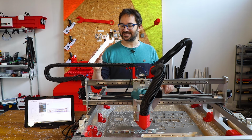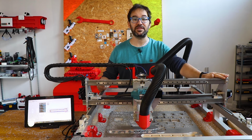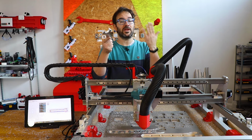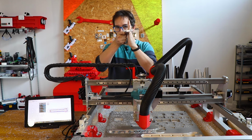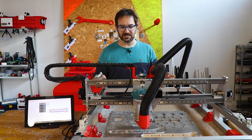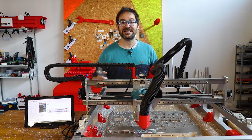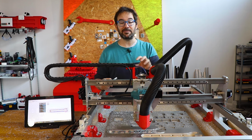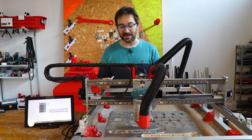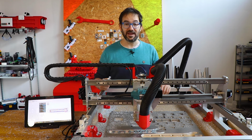So look at this. As you can already see, it was already capable of cutting 10mm thick aluminium. But now I can make perfectly straight walls, because when you want to make a part with another one like this and you need a straight angle, it was pretty difficult because everything was too flexible and the bit kept tilting. Now it doesn't. I even did an 8mm dip cut at 100mm per minute, which is insane. Huge chips coming out of the bit. And it plowed through. So it's now an extremely capable machine.